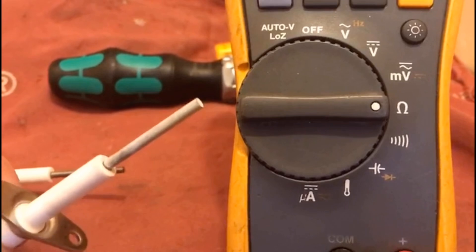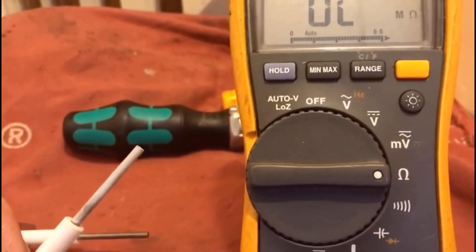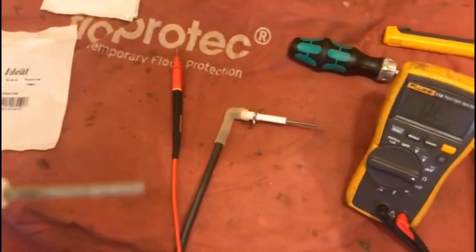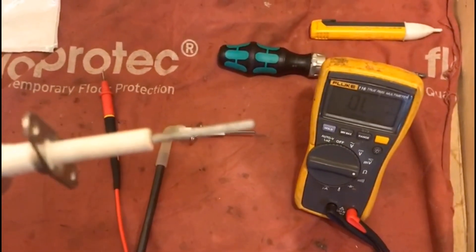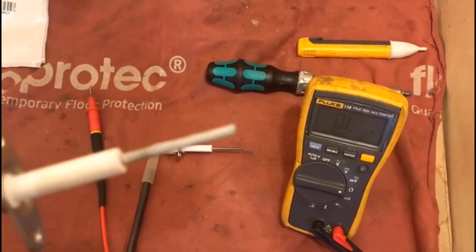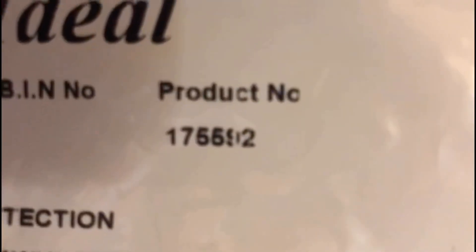You can clean this on a service — use a little wire brush or a bit of scotch brite. I've seen people use a file but I think that's a bit harsh. You can normally clean the carbon off and stop a fault occurring, but if it's gone too far then you'll need to replace it. The part number for the Logic harness itself is 175604, and the detection electrode is 175592.